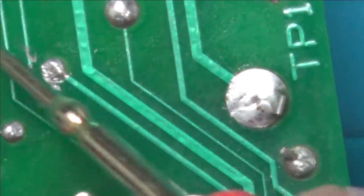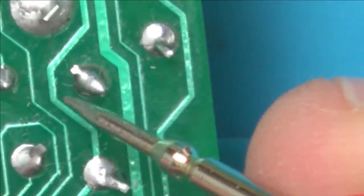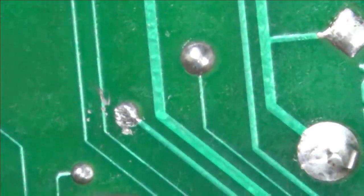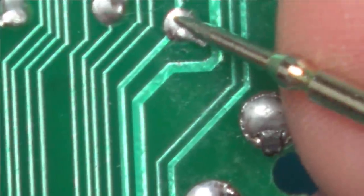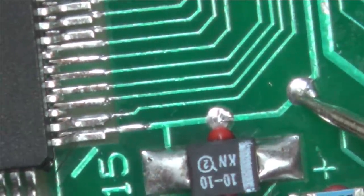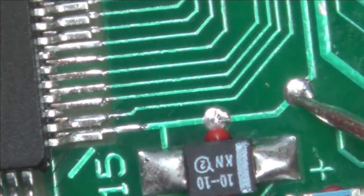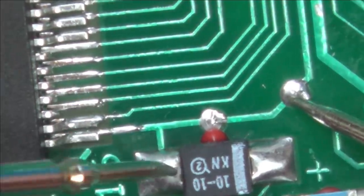Now watch this. From this path, it goes down, down around here, down, down to here. And now I'm just putting my meter here and here. And you can see I have got continuity, yeah? So that's all good to hear. Now look what happens, it goes down, down here, to this point here. And if, for example, I go between here and the point that I've just shown you, I have got continuity. If I go between here and here, continuity, here, fine, here, fine.